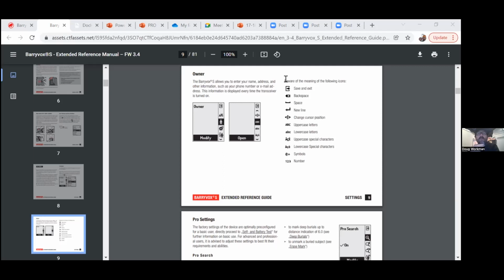Why doesn't the transceiver auto switch to the closest signal when you move between multiple transmitters? It seems to eliminate the user's ability to fall back to the 3-circle method and micro search strips. This is a great question. And the reason for that is that if you think back to older beacons that didn't have marking, like a Tracker 2, if you have 2 or 3 victims out there, then the numbers are flashing back and forth: 1.2, 3.6, 4.8, 1.4, 3.8, 4.2. And it's the user that has to disseminate that information and make decisions about which is the closest and how to get closer to that number.